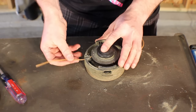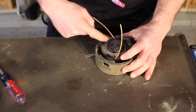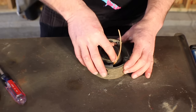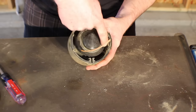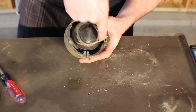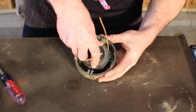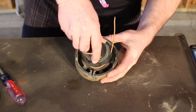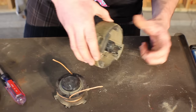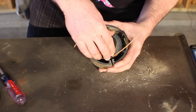If you're out of line you won't see the line on the spool, just the tabs. Also, that's why these eyelets are here — so you can put the line in there, and that way after you spool it, it's not going to bird's nest. One thing to look for when you take your head off: this spool has tabs on it and the head has two tabs up off the back of it — one here, one here. The tabs on the spool actually rest underneath, and there's a spring in there. So with the tabs locked you can turn it and it'll pop right out. You can see the spring there, and those tabs are what go underneath when you go to reinstall it and lock it in place.